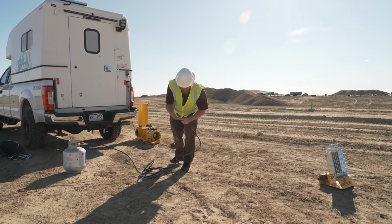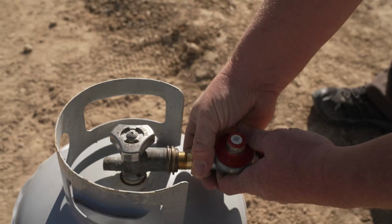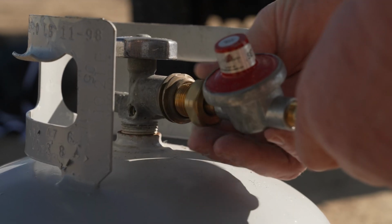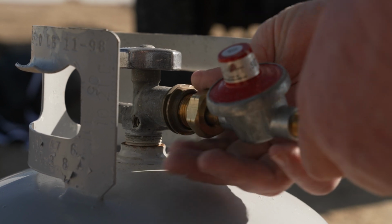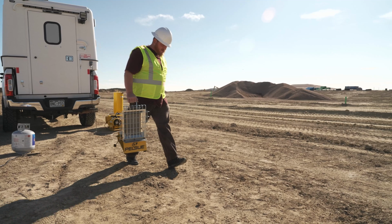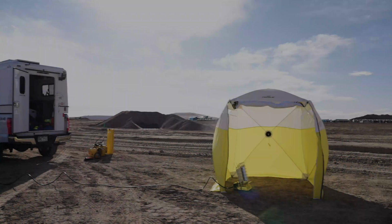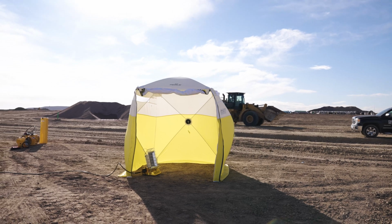Your infrared tent heater is designed to work with a DOT or CTC approved 20 or 40 pound vapor draw style gas cylinder. Use a two-stage regulator system when running the heater. The first stage regulator is built into the hose assembly, which is attached to the propane bottle. This drops the pressure to 10 psi, and the second regulator built into the unit drops it even further to roughly 0.4 psi. Your workspace should be well ventilated if used within a tent or shelter.